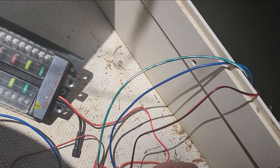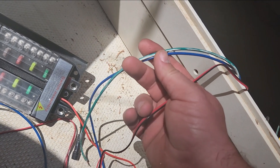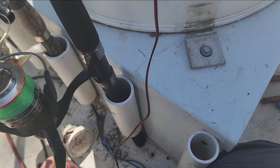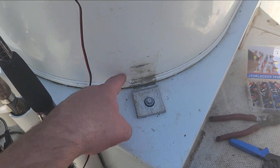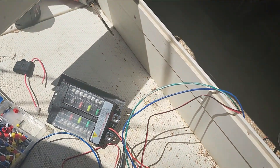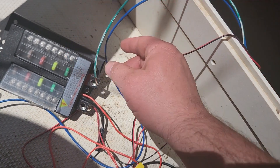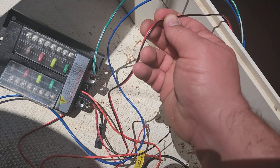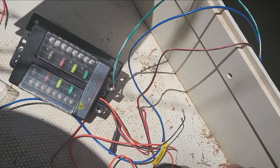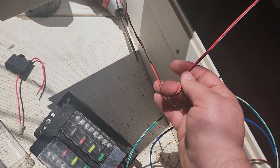Here's where we are — with the panel on the sliding bracket I can pull it out and work on it easily. This power and ground is for the bait tank down here, and I've got a new pump. I'll run conduit and use zip ties to clean everything up — it's all temporary. The bigger wires are needed to run the pump. Here's the fish finder wire and the light on the front of the console.